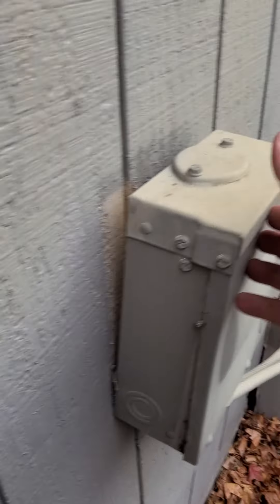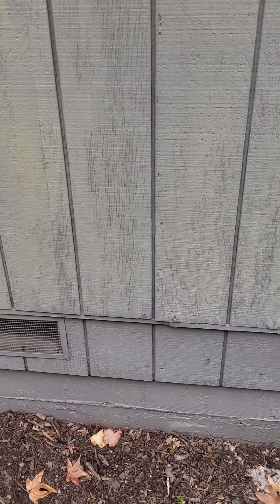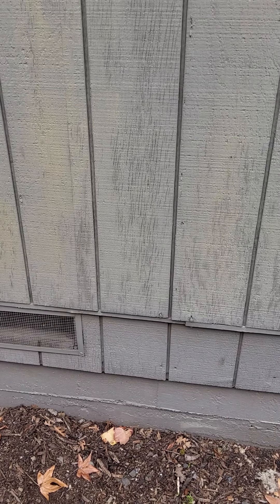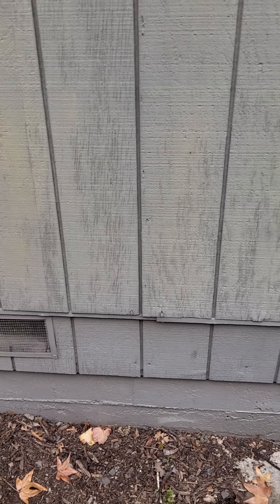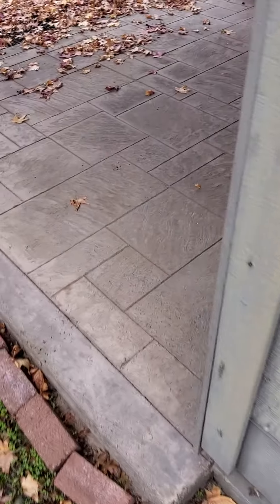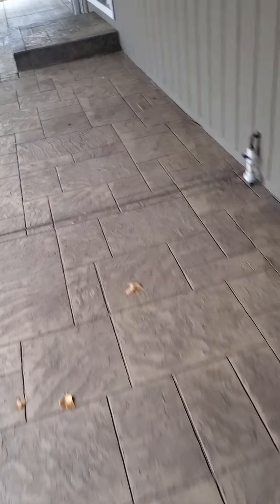That's obviously not good. I'm going to go in the attic because I'm hoping we don't have insulation there. If there is insulation in there, I'm concerned there might be too much moisture, because these are the only vents in the crawlspace. If there's insulation in there, I'm going to be really nervous about the condition of the joist members.